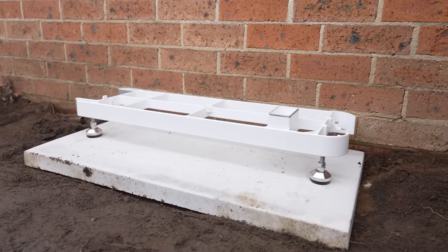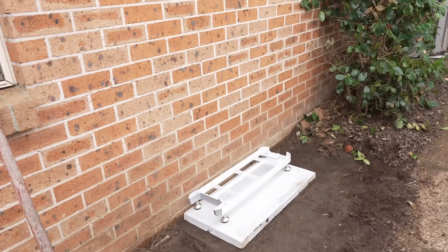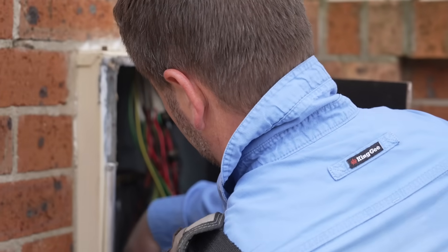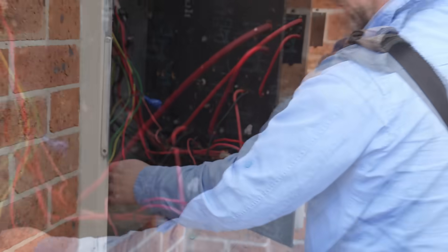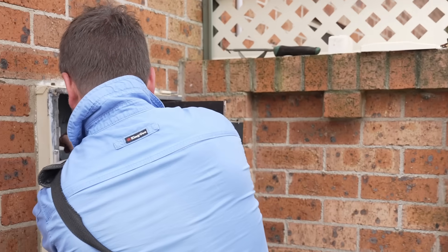It's just something I think every home is going to have in the future. So while Sam and Ezra were on the roof, Sim got started on the battery and the gateway. Really important when you're choosing your battery location is find a spot that has a 600mm gap from any clearance of openings. For me, this was outside my garage - a perfect spot. It's out of the way, it's subtle, and it's right near the switchboard as well.